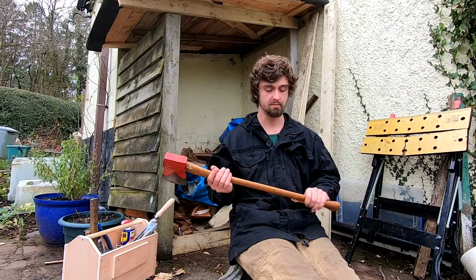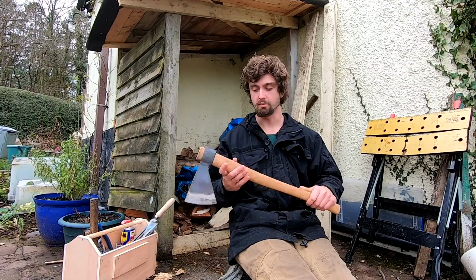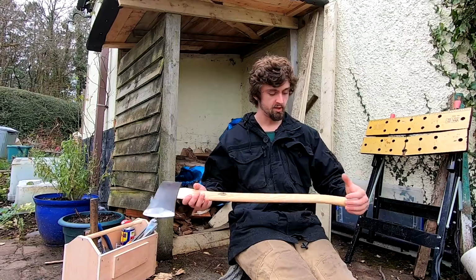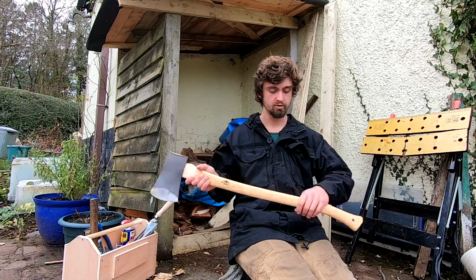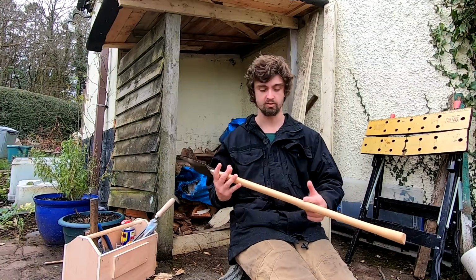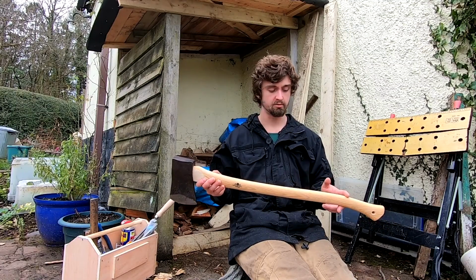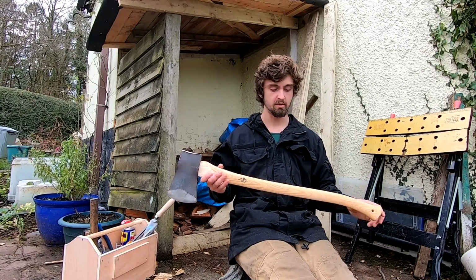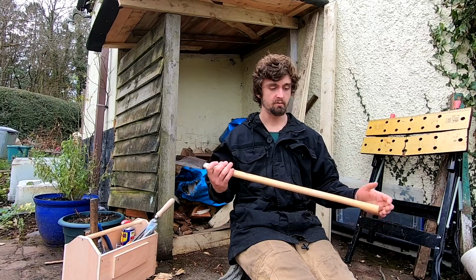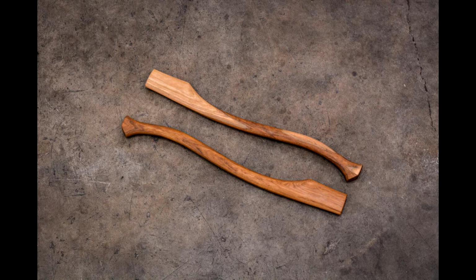So if you have a straight handle, it needs to be quite flat, and these traditional European axes with straight handles and unbalanced heads are always really flat. So what you get with a curved handle is really less to do with the curve up here, because this handle is fairly straight, and a lot of the actual historical handles I own are quite straight. Some you can see in pictures are quite curved as well, but I don't think you see as many as commonly curved as some of the really extreme curve handles made by some people today.